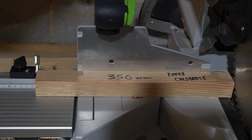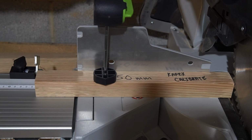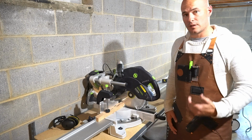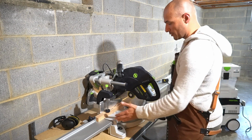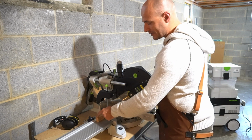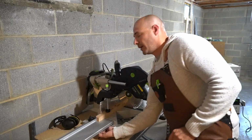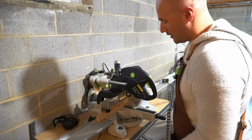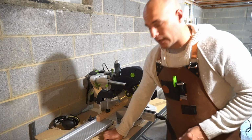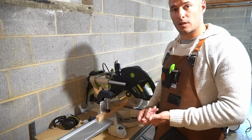And then I'm going to take my miter lock. I'm going to lock that stock down in place. And now that I have my scrap piece in the appropriate place for the appropriate measurement, now I'm going to slide my extension over until the flag stop touches my stock. Nudged up against our stock blade, we're going to tighten the attachment knob. We're going to go through with our Allen key. We'll tighten everything down, and then we'll do a test cut on another piece of scrap.